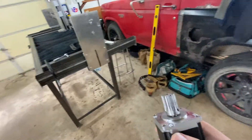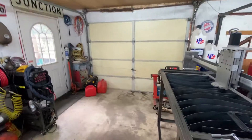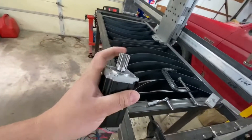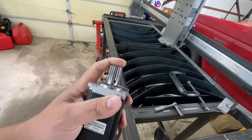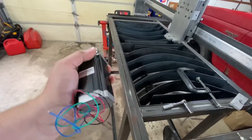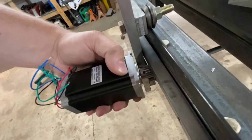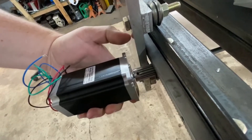Also in amongst all of this — I threw the pinion gear onto the motor shaft. I do have the pinion gear on this guy now. I drilled out that hole a little bigger and that was harder than I anticipated, but I got it on there. This one's probably not coming off this motor. But I was setting this up against here, and if I bottom that out, I'm actually not going to need to countersink into this plate — I'm going to need to space it out. So I kind of did some guessing — a quarter inch should be enough.